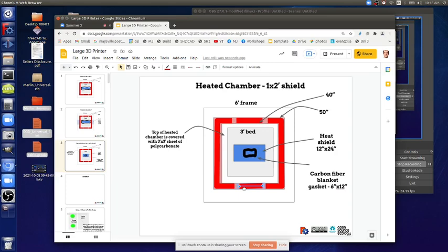Yeah, yeah. Do you want to do that, or are you working on other stuff? Because I wouldn't do that. I've worked with this kind of roofing. It's not easy to work with. That's why I'm proposing the rebar. And then on the rebar, we would actually do something like 24-inch wide aluminum flashing, so you can slip the insulation in there really easily. Make the frame out of rebar, put the flashing in it, and then you can slip the insulation in very easily and have the exposed edges.